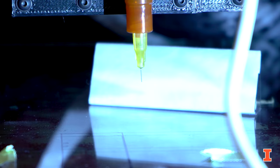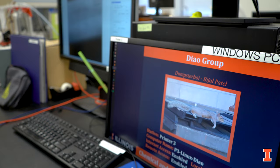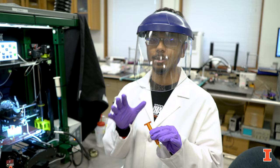One of the core aspects of our lab is to make the production of electronic devices a lot cheaper and easier, and we aim to do this by using solution printing techniques like this. As you can see, our removable print head has a syringe which contains the ink — in our case a solution of the polymer — and we release the solution by applying pressure to it.